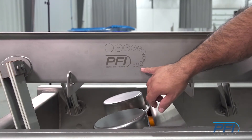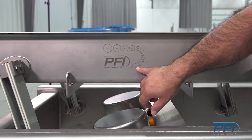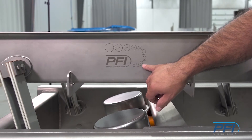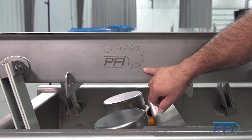Hi, I'm Hiram Garcia, Senior Field Engineer for PFI. Today we'll be tuning a VibraFlex II. What we have here is the displacement of this unit — or stroke as we would say — is at a quarter inch. What we need to do to tune this equipment and bring it up to 5/16ths displacement is adjust the counterweights of the drive motors.